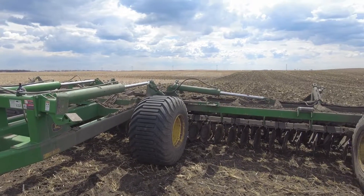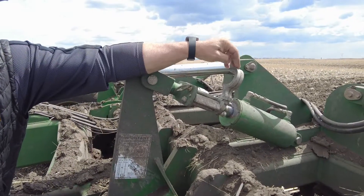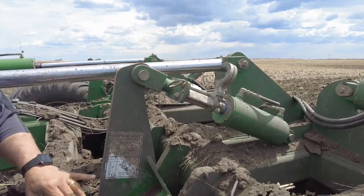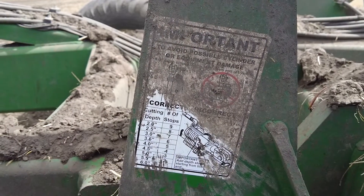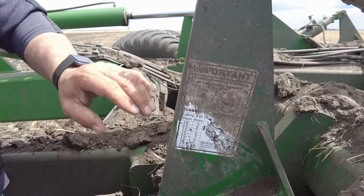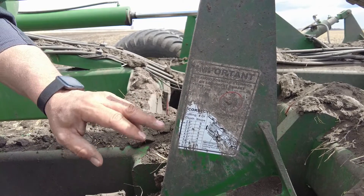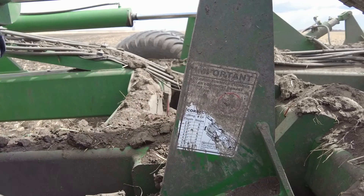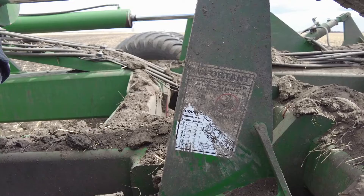A lot of things here — these are all positive depth stops right here. If you look at these, they contain a half inch for each shim you add. This machine is capable of going from two inches to six inches deep: two inches with all the shims in, six inches with all the shims out. The gauge is sitting right on the side here that you can look for your question. Whatever depth you want to try going, you can just look at this chart, reference that, set everything equal, and the machine will be running level.